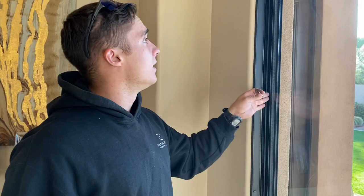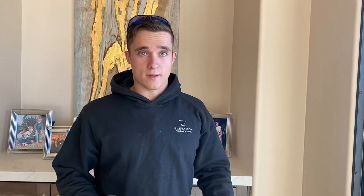I didn't pre-drill this one, so this one might be a little bit more adventurous. I've already set one in the top and we already showcased the one in the bottom, so we're going to do one in the middle. I like to usually do three as standard for all the sliders that I'm doing — unless you're getting down to, let's say, below eight feet in slider height, in which case we can do one in the top and one in the bottom.